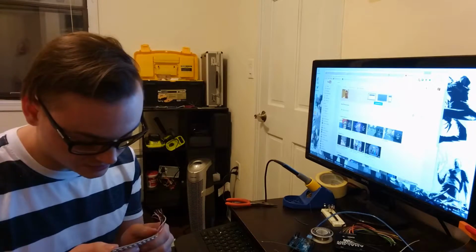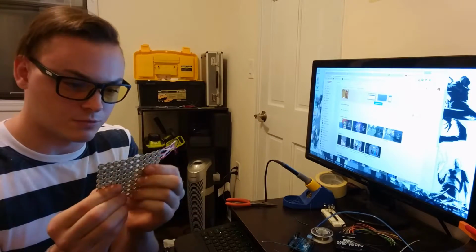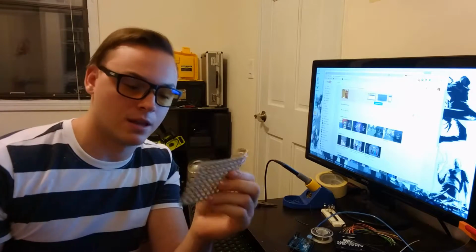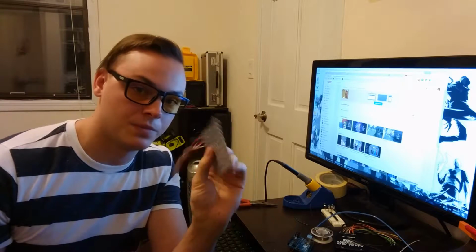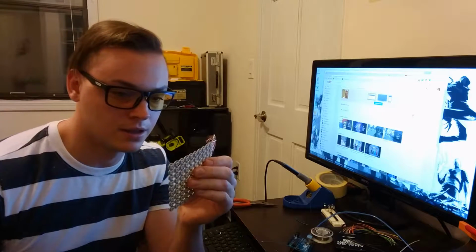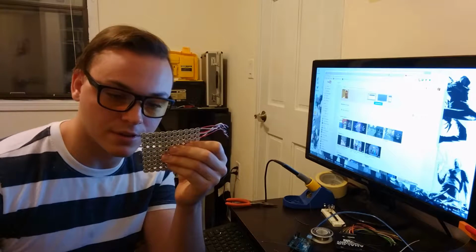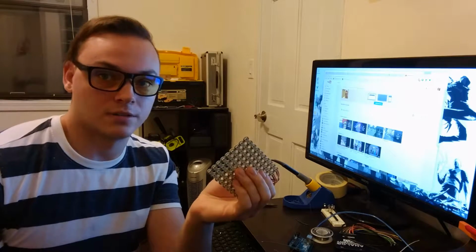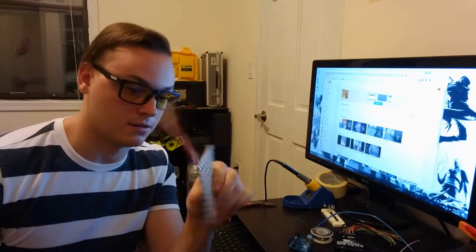So what I did so far is that I have 3 lines: power, ground, data. Basically to test each one. I had an issue actually when I wired it all up, the colors were kind of changing together. It must have been losing data, or there could have been crosstalk or something like that. I remember from reading the Adafruit documentation that it's very specific about its timing. And if you have crosstalk from, say, one data pin to another data pin or some other thing, now the solder joint looks pretty crappy, that could cause issues, and that's kind of what I was seeing. So I tested all 3 of these lines individually, and they worked just fine.